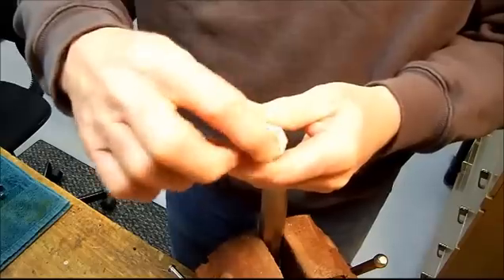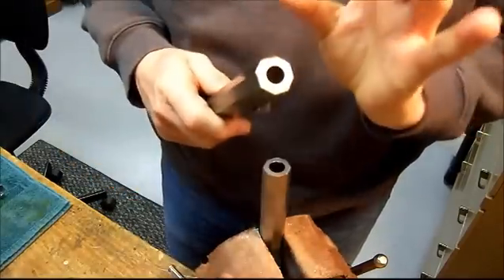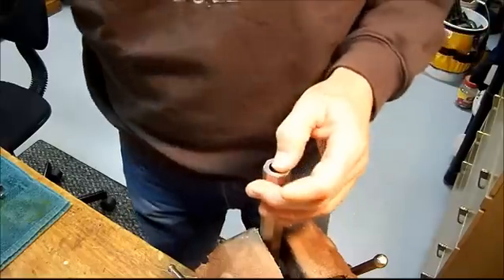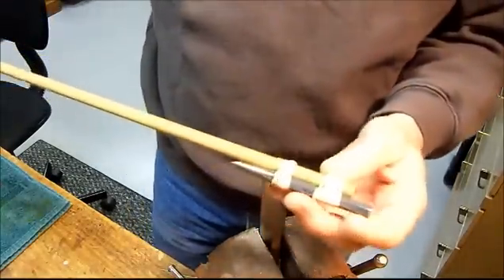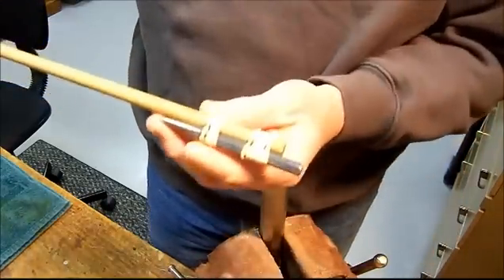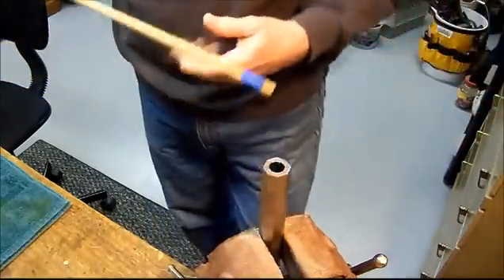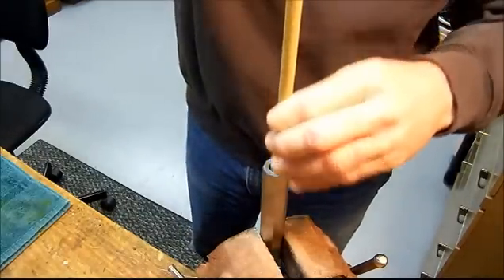This is nothing more than something I've been playing with. The spacing on it is way off, so it was obvious I needed a jig — I cannot eyeball it that close. This is my jig. All I've done is taken about a 3-foot dowel, rubber-banded my center punch to it. The other end I've taken some masking tape just to take up some of the slop.